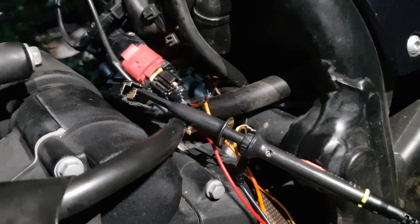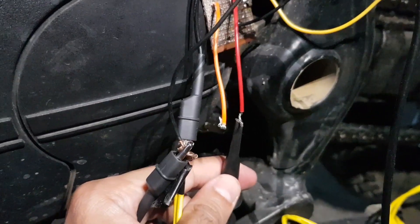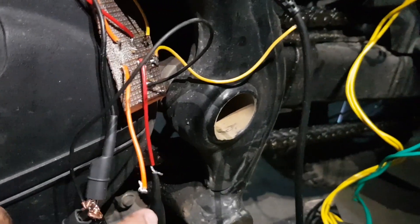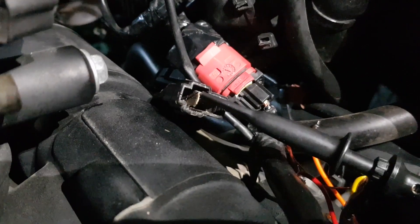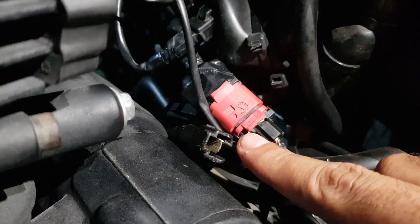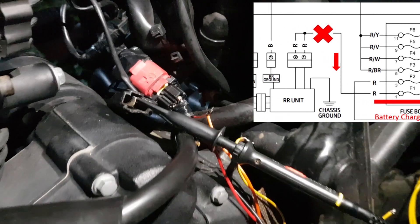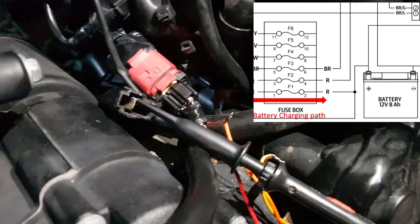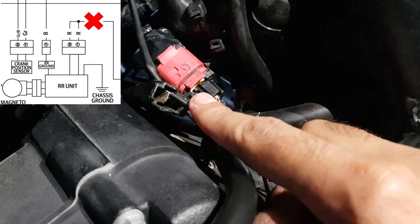In the second set of waveform studies, I am connecting one probe to just one phase among the three phases, and the second probe to the rectifier output. I have disconnected the rectifier from the battery to see how pure the DC waveform will be. This experiment can only be done once or twice since the battery will drain quickly when the rectifier output is not connected back to the battery, so we have to perform it very quickly.